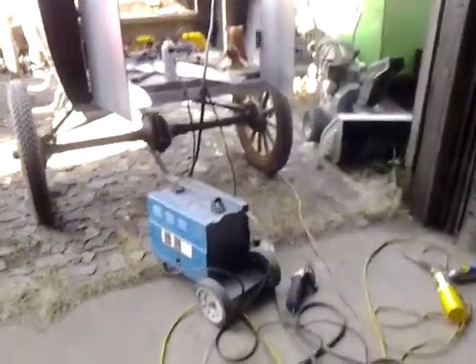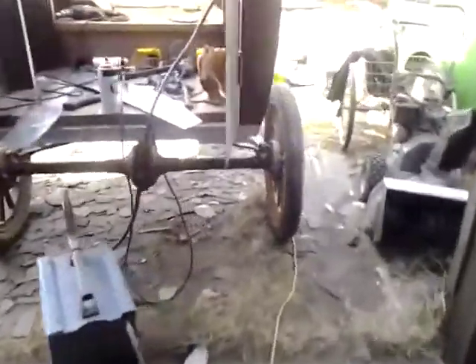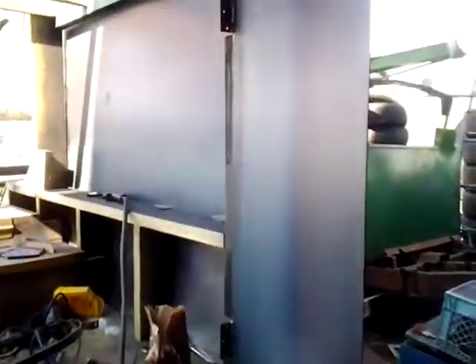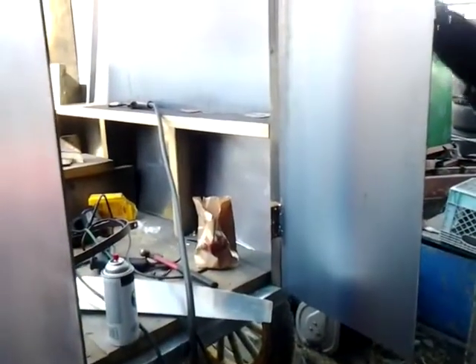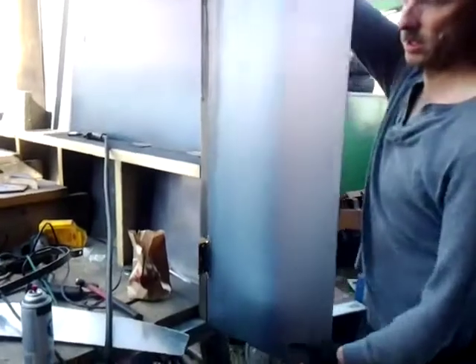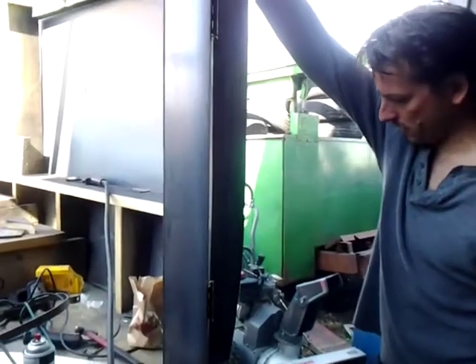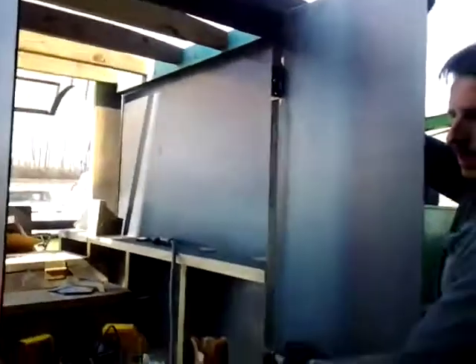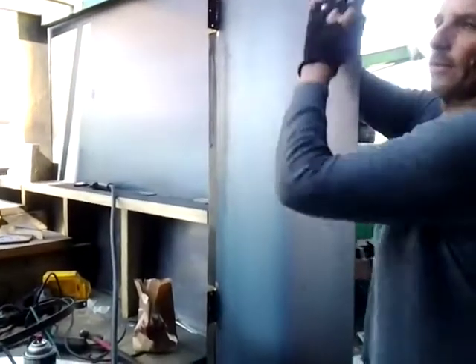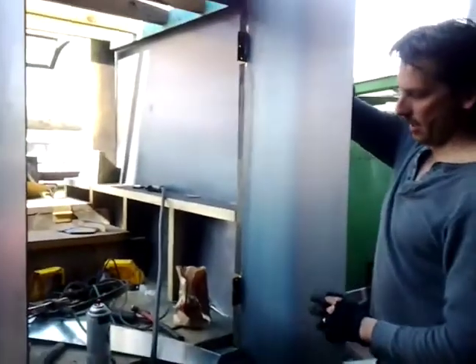So I'm back at the shop. We haven't done a video since last week, and I wanted to just do a quick update. Chad is welding on the side doors. He cut the back doors yesterday and welded them on, so now he just has to do the wood backing. Because these are heavy - this is eight-gauge steel - so I welded them onto the hinges, and then what we'll do is back it with two-by-fours or two-by-sixes.